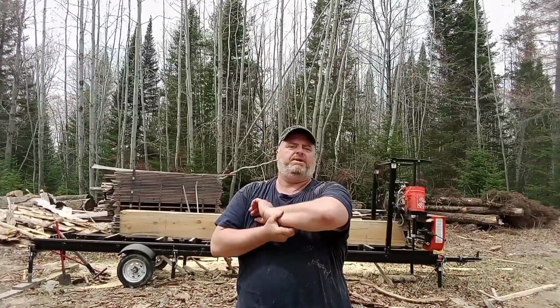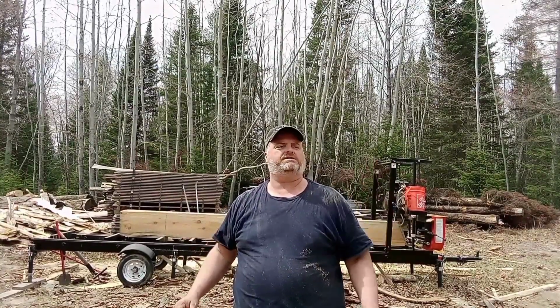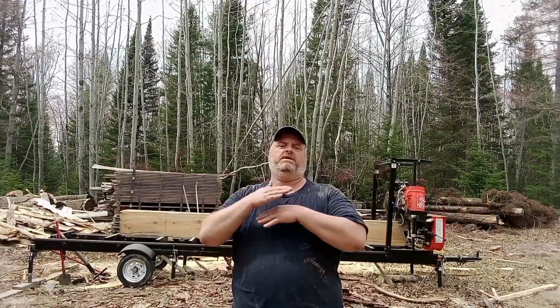At the end of this video, I'm going to add in a picture of the plans I have if you want to pause the video and get an idea of what we're doing, or build some for yourself or some friends of yours or anybody that needs wheelchair accessible raised beds. But before I do that, I'll actually walk you over and show you how I'm stacking this so that the boards, if they're left like they are, they'll get moldy in between. So you put spacers, they call them stickers, in between the boards to hold them apart so air can flow through there. So I got a stack of 2x10s over here that I'm also using for this project. So I'm gonna walk you over and show you that, and then plug the pictures in at the end of the video, and I'll wrap this video up.